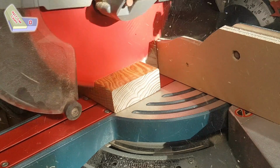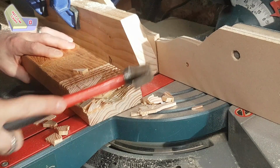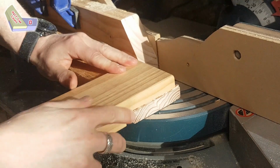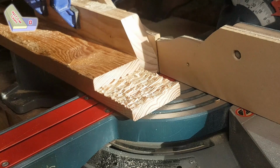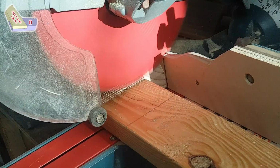There was also a bit of a technique to the trenching, and I got better as I went along. They were probably a bit thin there, I didn't have to cut them out quite that thin, but it was very therapeutic to belt the crap out of them with a hammer. With a test fit, if it wasn't working, you could sneak up on it very, very carefully by pushing the piece against the blade to flex it, and then you'd be able to knock off a hair until you got a lovely fit. Taking out the guts of this one so that the braces would fit in the middle there.